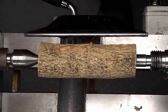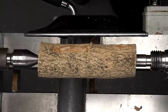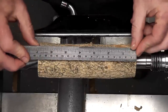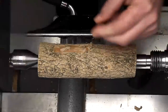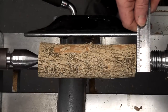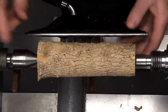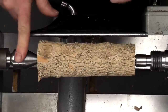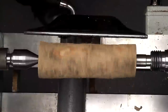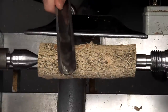I've got a lump of boxwood. One of you are going to ask, so I might as well do it — what is it? I've got my glasses. This is some of my gold from home. It's six and a half, nearly seven inches long. This end is two inch diameter, roughly; the other end is 50mm. We're mounting it between a pro drive and a revolving ring centre — my favourite tailstock centre. First thing we need to do is take it down to a straight cylinder, so we're just getting spindle roughing out.